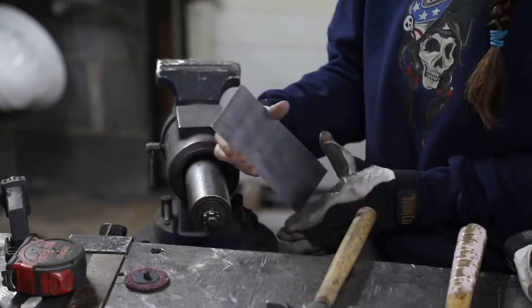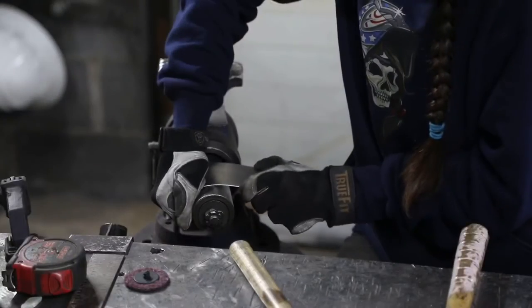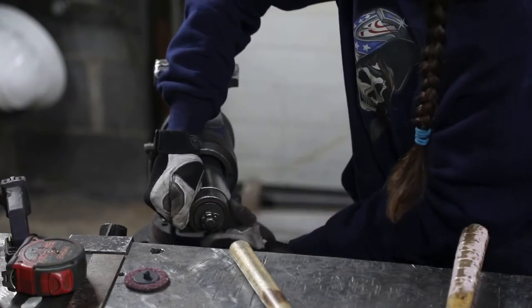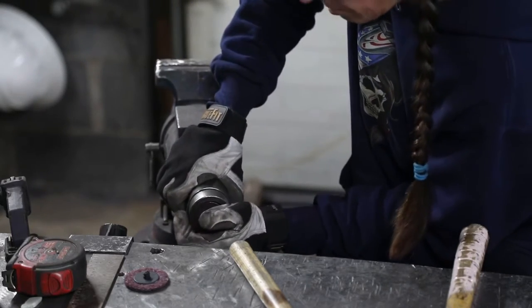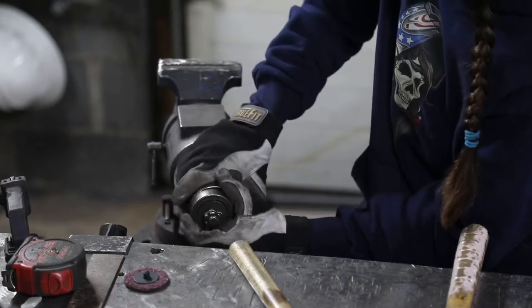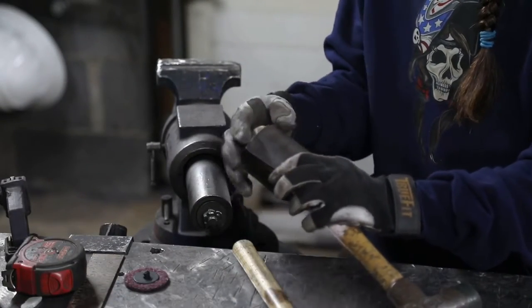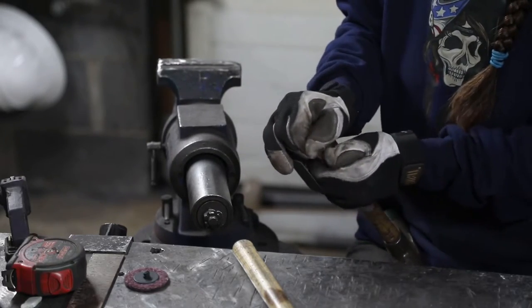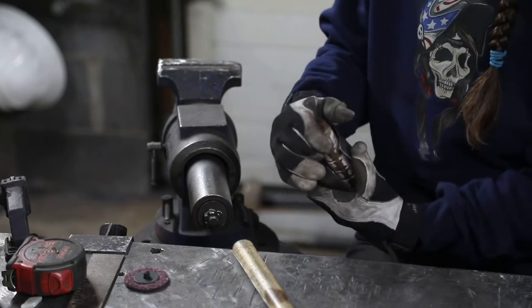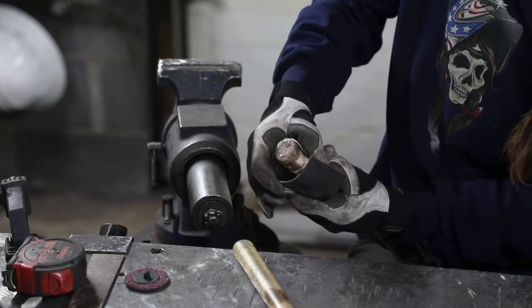The idea with this piece is to curve it and make it into the stem of your pumpkin. We can just bend it like this — look at how nice that works, a nice smooth bend. Get that moving, and when you get it started, use the handle of your hammer and the same thing by hand. Curl it around, mess around with that, form it, and get it bent to the shape that you like.